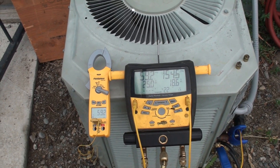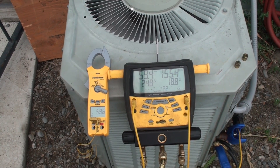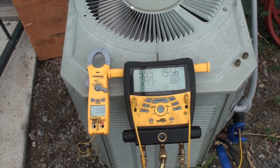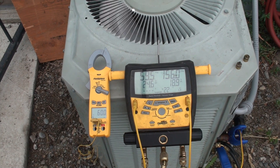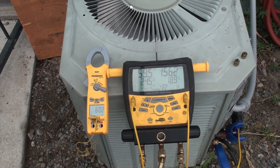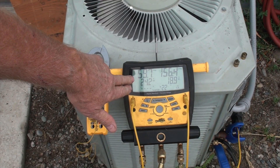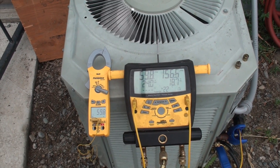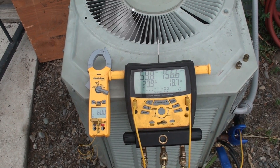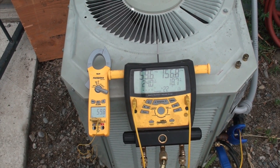After letting it come back down, our suction pressure is a little bit higher than it was before, but our superheat has gone out of sight. That's mostly because the head pressure has dropped quite a bit. When the head pressure drops that much, the pressure difference between high side and low side is reduced, so it's not going to push as much refrigerant through — hence the higher superheat. Now this is only with a fixed orifice device. A TXV-controlled machine is actually more versatile and more adaptable to lower outside ambients than fixed orifice systems, generally speaking — though not always.